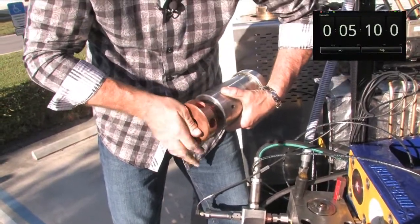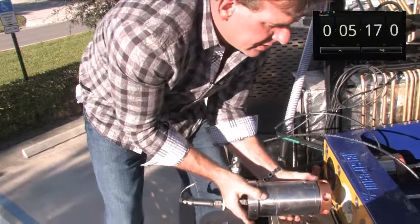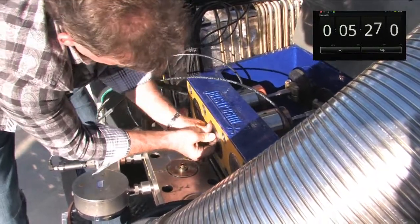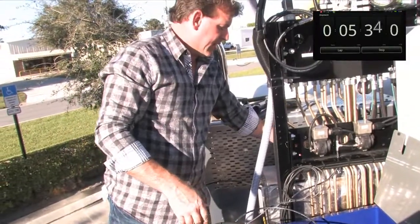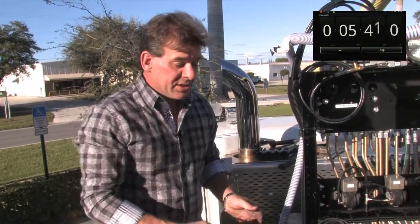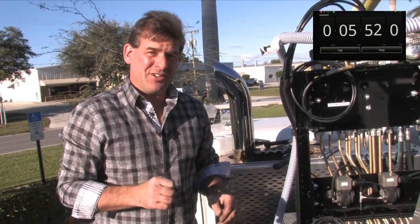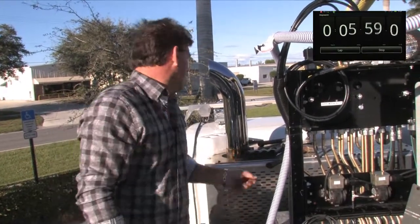To reassemble, simply screw it back together and slide it back into the chamber. I've taken some extra time to show you how really simple this system is. Other systems might have five plungers, but this pump achieves 12 gallons a minute by having three plungers with a longer stroke and a larger diameter plunger, so you can pump the same volume with fewer plungers. Now we're ready to reassemble the pump.